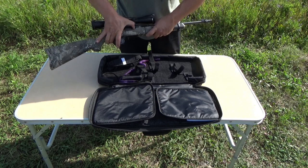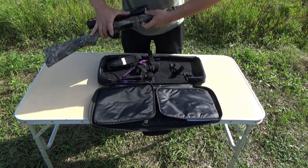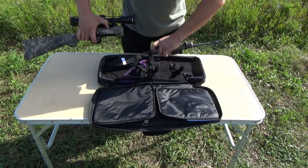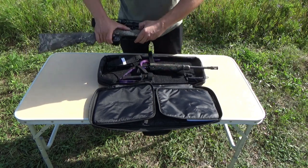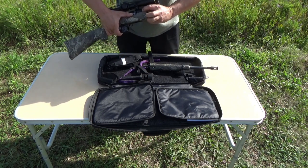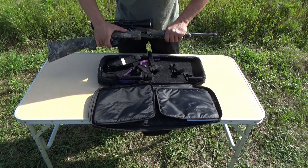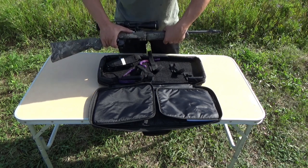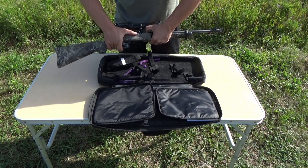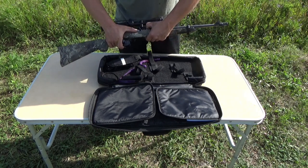All you have to do to take it apart is pull this little lever forward, pull your bolt back, twist it, and then it comes apart. See, what I've been messing with is tightening up this collar, because you can adjust it. All it's doing is pushing this slip collar forward and putting pressure on the cam so that it locks in place positively. So I've been tightening up that collar. Okay, that's a little bit too much. Until it's just real snug to engage.